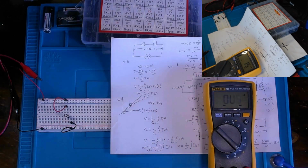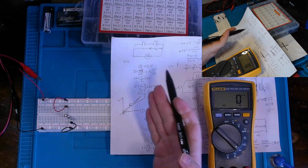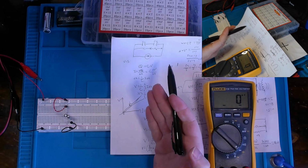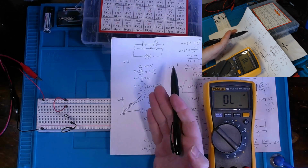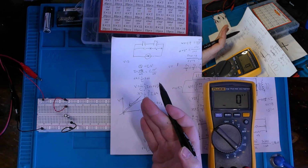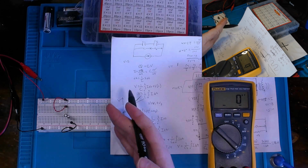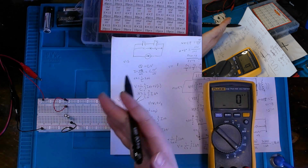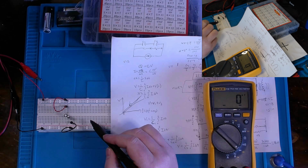So it is essentially clear from the equation that we have here that when two or more capacitors are connected in series, then they can be treated as resistance connected in parallel. Hence, the equivalent capacitance in series circuits can be calculated in the same manner as equivalent resistance is calculated in case of parallel circuits. Well, if that's how capacitors function in series, the opposite of resistors in series, more like resistors in parallel, then how do capacitors behave in parallel in circuit?